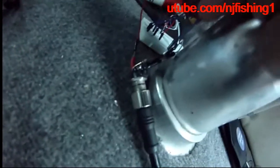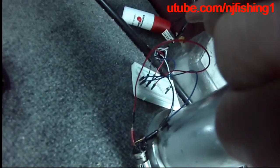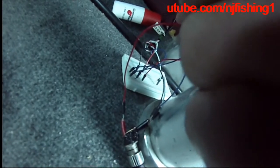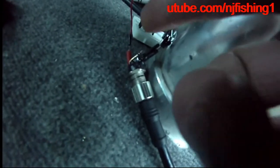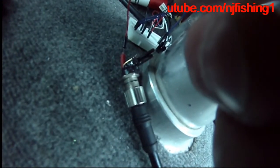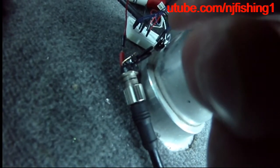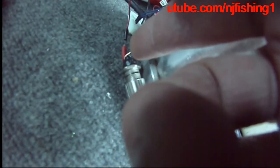I figured out the four pins on the Command Link plug: the four colors — red, black, blue, and white — and then mapped them to the NMEA 2000 four pins as well. The red color is for 12-volt power and the black is for the negative for the battery. The blue color in the middle is for the NMEA 2000 signal.